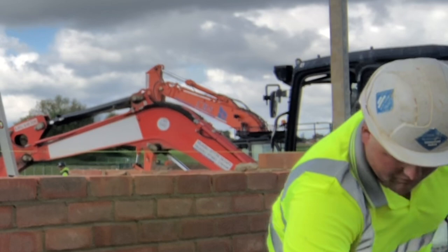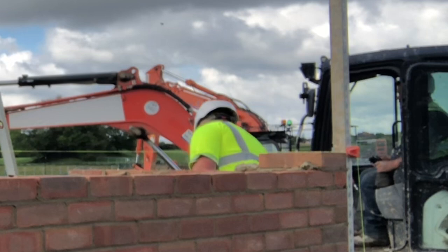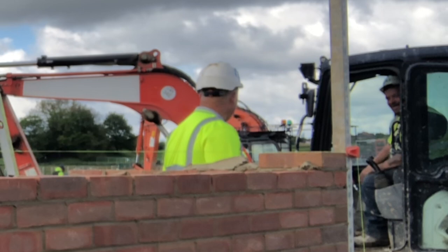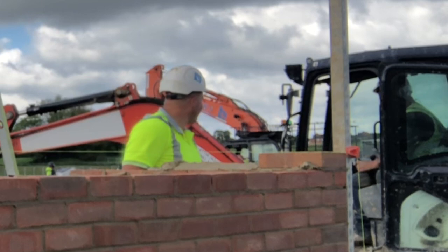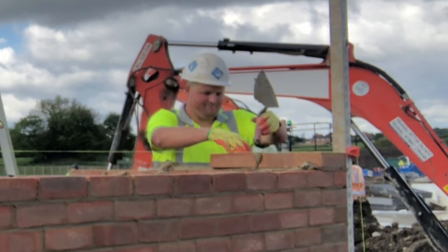So it's getting that sweet spot with silos where you're getting just the right amount of water — not going off super quick but still has life in it. I used about one and a half tubs today, which was a decent day considering we were on double-sided pointing. These bricks are super dry all the time; with temperatures at a higher average the mortar was like clay this morning — it was horrible — so I was struggling to get them down.